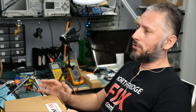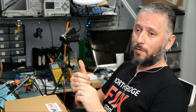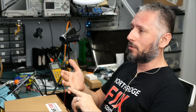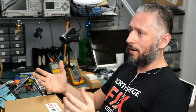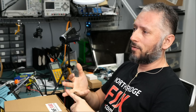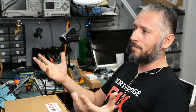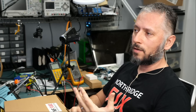If you go to Amazon and search for a fume extractor, you'll see a lot of carbon-based fume extractors. A carbon fume extractor does not filter out anything except odors and smell — and not even 100%. It does not filter out microscopic particles or big particles. You will still have the same toxic fumes in the air. People rush and pay 70, 80, 90 dollars for a carbon-based fume extractor that does absolutely nothing.